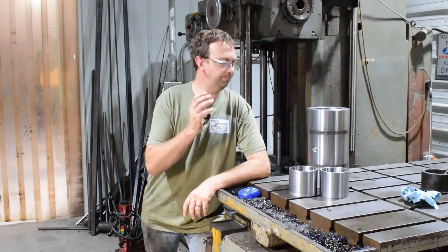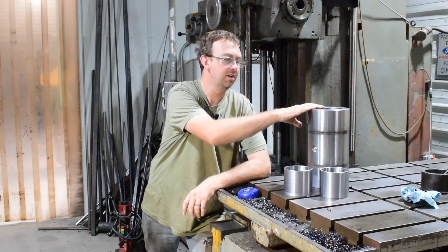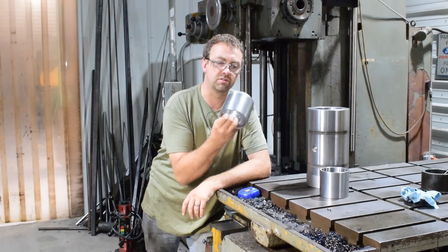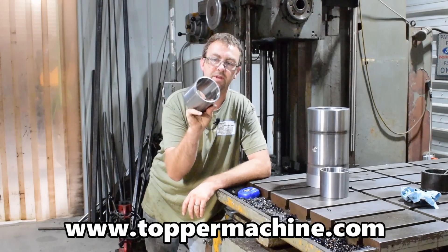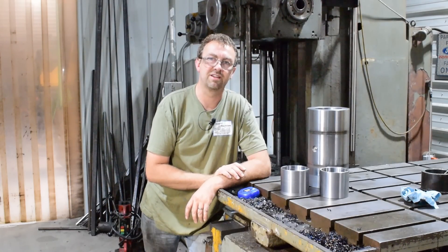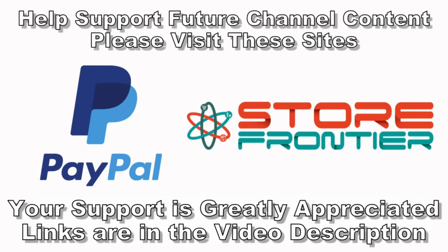I don't know when my microphone battery died, but I'll try to do a voiceover for everything we've lost. But they're all done, ready to go. They're a one thou press fit into the receiver here that gets welded on the end of the boom. And once he starts welding this on, it should warm up enough they'll slide right in - so a perfect fit. Got the grease grooves in there, which will work out nice for them. The only thing I don't like is the material that the customer brought me - this is not the material I would have chosen for this application, and I kind of expressed that when I started this. But this is what he wanted and this is what he's going to get. So until next time, get out in your shop and get it done right the first time.